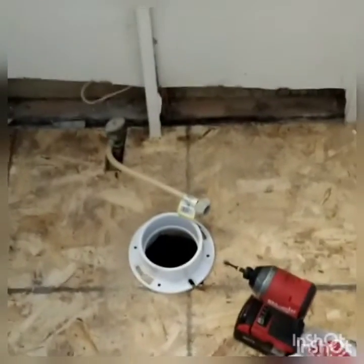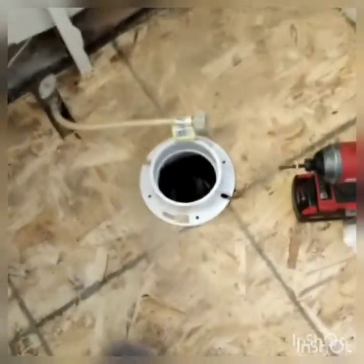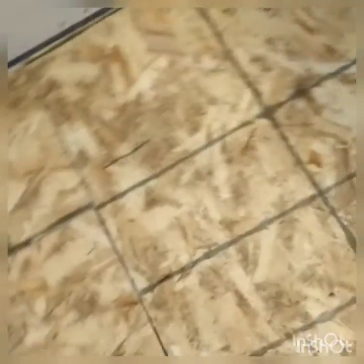I'm trying to do this in a hurry because the boy's asleep over there in the bedroom on the other side of the house. There you are — floor for the bathroom. Because all the screws went in, and as I was running the screws through it I could feel the floor squeezing back up. So it supported it — it's solid. We put a new ring, make the attachment, put the wax, put the toilet, screw it down. She's going to cut some linoleum or something. We're going to cut the linoleum to fit, just like that — I already got the measurements.